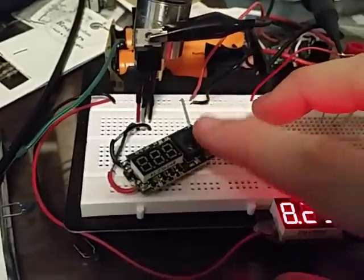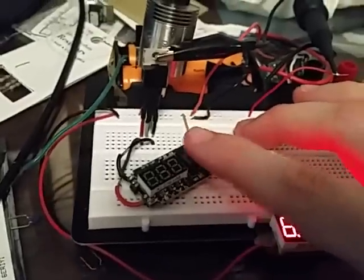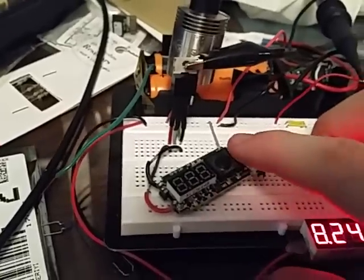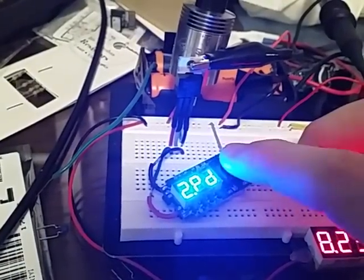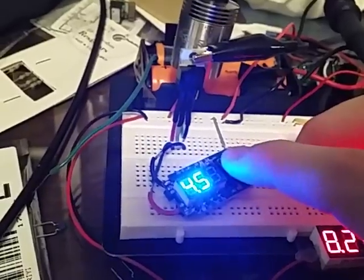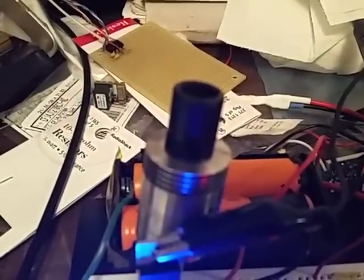So you have 6.4 volts to work with loaded. That can be a limitation for you bros out there who like to drag your volts down to 0.3 volts on a 0.00001 ohm coil with four cells in series or whatever it is you do. So keep that in mind. This is set — let's go into the menu real quick. We're at 15 watts, which is irrelevant by the way. All this does is adjust the duty cycle. It doesn't know what wattage it's putting out anymore. The lowest is 3 watts. Nice little small duty cycle. You can't even hear the atomizer.